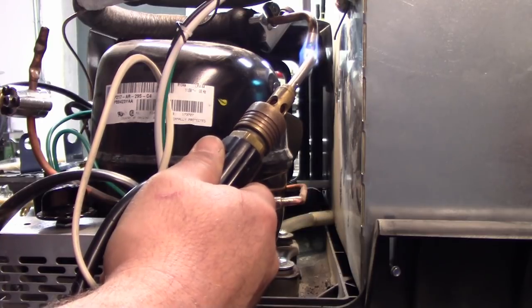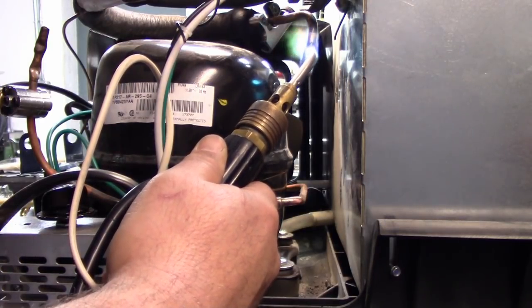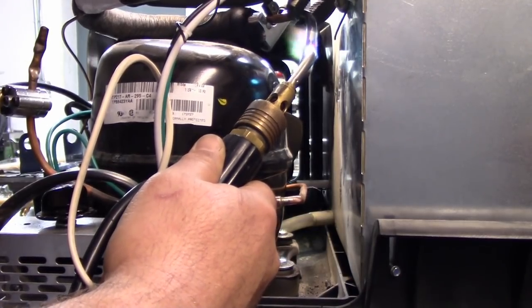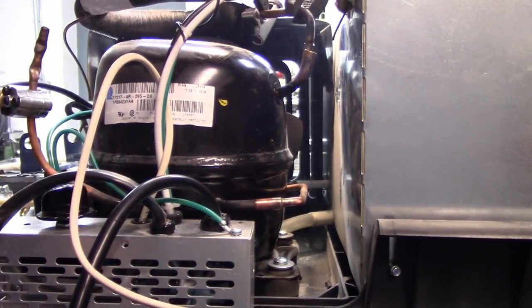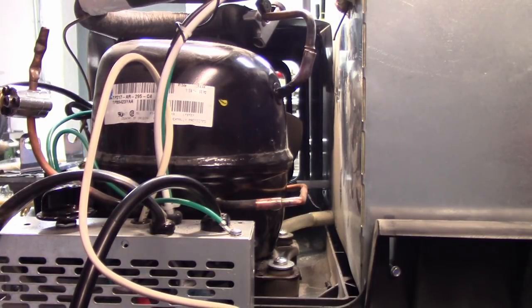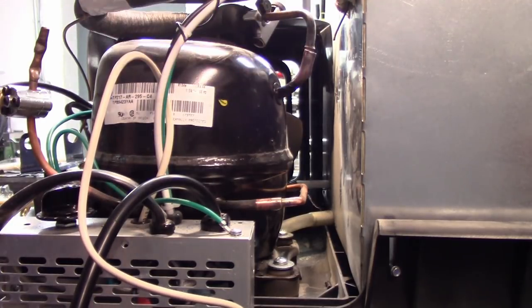With the hand wheel open and the high side cracked, there's my nitrogen coming out the other side of the system — so no pressure buildup and I can unbraze without any fear of carbon buildup on the inside of the pipe. We're just going to get that red hot, make sure there's nothing we're going to burn, heat the fat side of that joint, watch the braze melt, and pull up with a pair of channel locks. And there it is — a little puff, probably a bit too much nitrogen flow, but we're out.